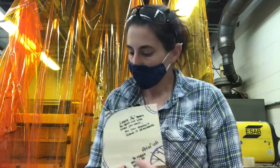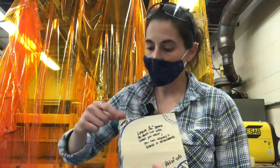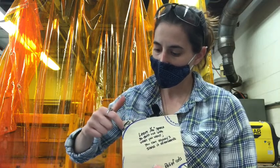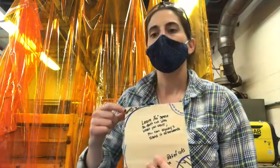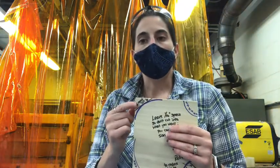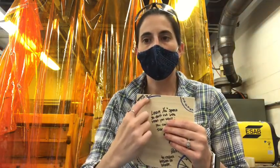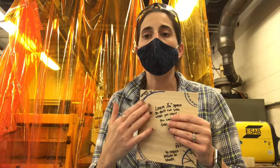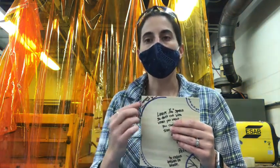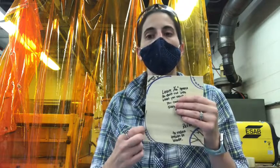If I have an external curve that I need to cut, I'm going to make what's called a tangent cut - that's just starting from one edge and coming all the way off. That's to get rid of as much material as I can, to save me time and effort. I can then do the same thing coming down this direction and across. I'm looking at that curve and thinking, what's going to be the best cut to get rid of most of the material I don't need to keep.